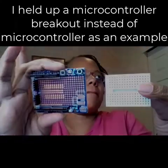Why is yours small? Okay, now, get an LED to put on your breadboard, any color you want. Put it wherever you want, as long as it's in a different row. I'll show you where I'm putting mine. I'm gonna make it look like it did when we did it in Tinkercad.